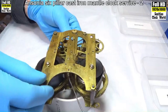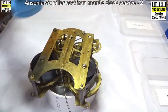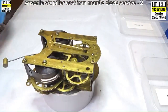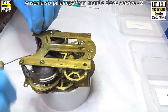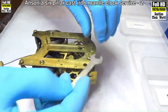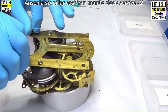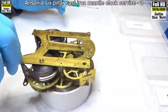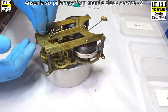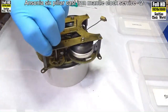We'll take the fast-slow winder out while we're here — that'll just drop out. Now we can undo the nuts a bit more. Remember there might be a little bit of tension left between the wheels, but we'll keep that in mind when we open up the plates. We won't just rip them off — we'll take them off very carefully and slowly.